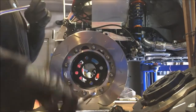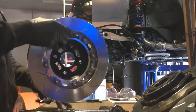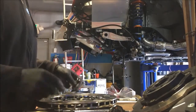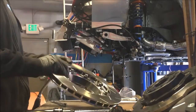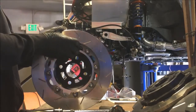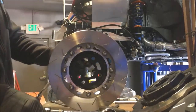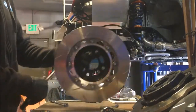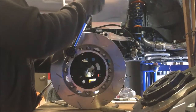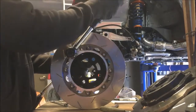I've got the 8mm Allen on this — that goes in the bolt on this side. A lot of guys try to assemble rotors flat on the table, and then they're working off the table trying to get a tool underneath, which just ends up being a headache. I've found the best way is to set it up vertically, so you can easily access both sides. I've got the wrench on the backside and I actually don't hang on to the handle — that just sits and rests against the bench. And then with the torque wrench, instead of pulling up, which is going to be really difficult to hold the rotor down, push down into the table.